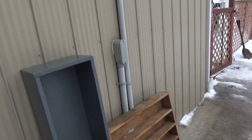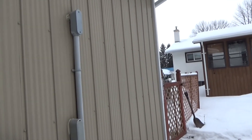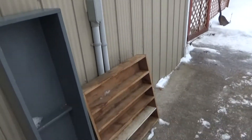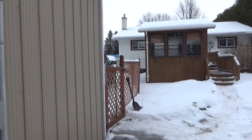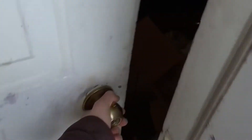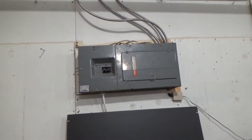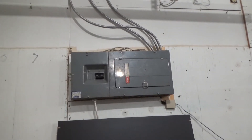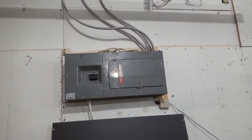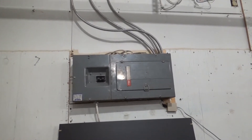The first thing you want to make sure is you have power running to the garage. This place here has 100 amps coming from the house, so I've got quite a bit to work with — it goes into the cement underground in conduit all the way to the back. Before you decide on a heater, you've got to make sure you have enough power and find out what upgrades you may need.